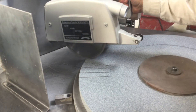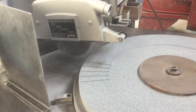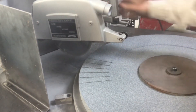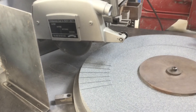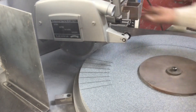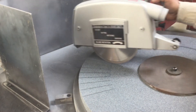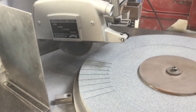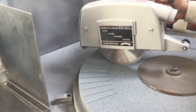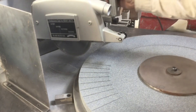These cuts are set every two degrees. The depth of these cuts is 0.825. We're using a special diamond saw for this operation, and we have a special indexing table that indexes precisely at the two degrees.